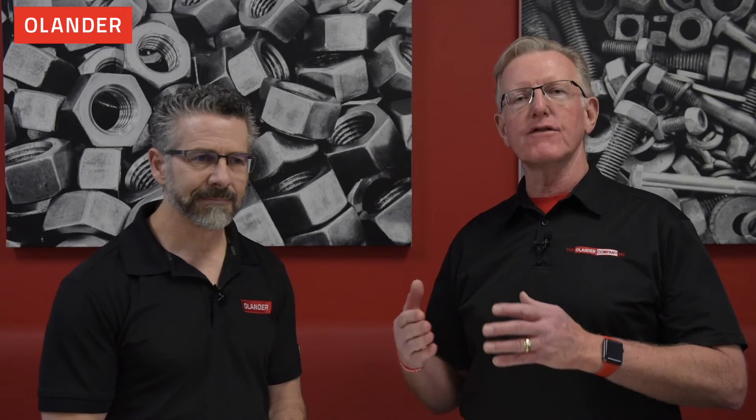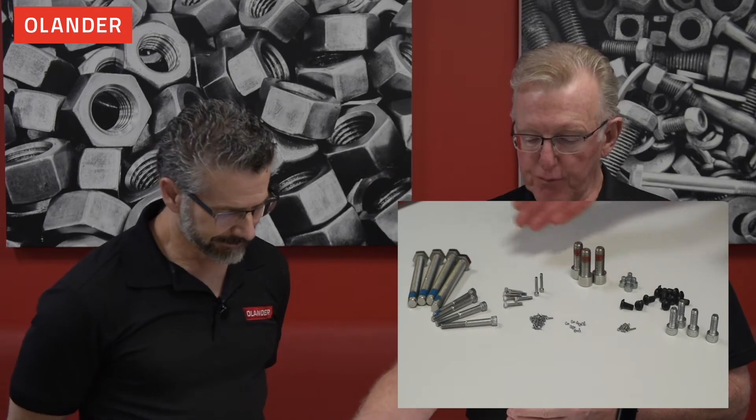The big difference in what we're discussing today is two different aspects, more towards the patch aspect. A patch is, as Doug stated, a nylon that is sprayed on the threads to push it to one side. With the different colors that we have, you can have different thread sizes made in different colors of nylon in order to keep them separate — you don't want different screws mixed up in your application. As you see here, we have a red patch and a blue patch, but we're also able to do many other colors, including yellow. We're also able to do nuts as well as bolts.